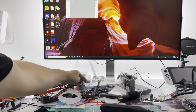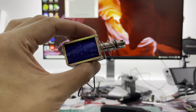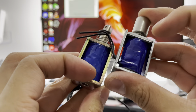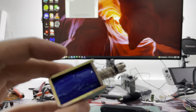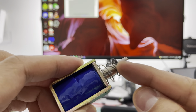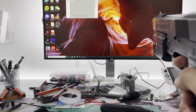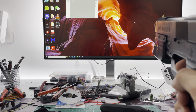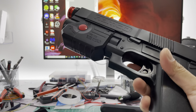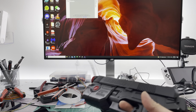In this case, we're using an open frame solenoid — it's a third party, of course, because the AimTrack originals are ridiculously expensive and don't last too long. If you look closely, the magnetic portion in the center is a little smaller and a little weaker. But it makes the sound — same concept, it's smacking against itself, but there's no big metal bolt to cause that action, so the sound is not going to be super loud. Personally I like it this way — it's not very disturbing or distracting. You can change this in the GUI, turn it off if you like, or make it rumble only, so when you shoot it'll rumble and when you reload it'll rumble. Currently it only rumbles when you reload.